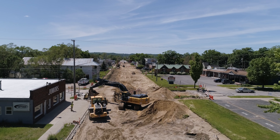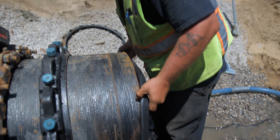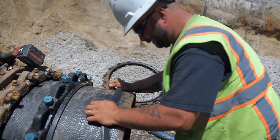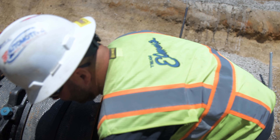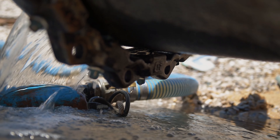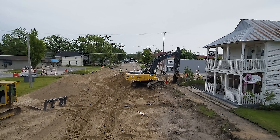Should an emergency arise where a water main breaks, or you need to tie in, or something happens where you need to access that water main — but you obviously can't get close to it because of the danger of the flowing water coming out of it — you're able to shut down that section of line without closing off a whole street or a whole section of the city.